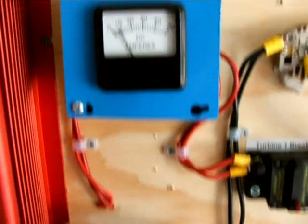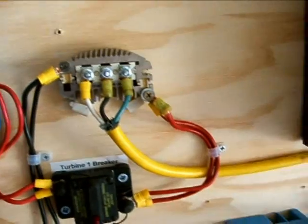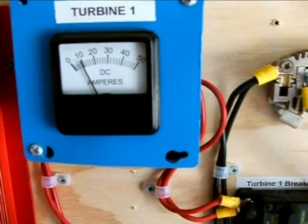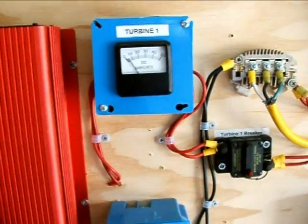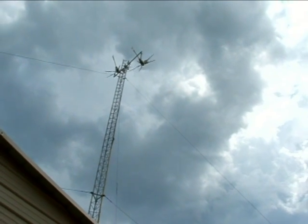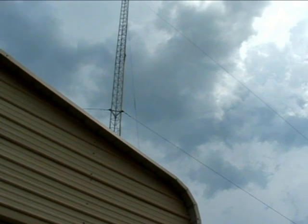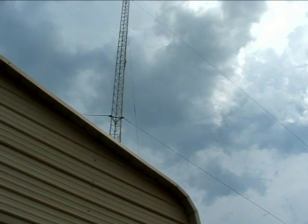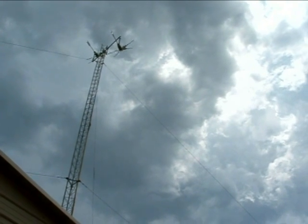You can see it's hitting about eight amps or so — about eight amps here. Very light winds, not a whole lot going on there. So right now it's 10 amps on one, so you have a total of about 16 to 20 amps between the two, on and off. That's 20 amps into probably a good 13 volts — right now it's over 14 because I can hear the dump load working, which means it's over 14.2 volts. So 20 amps into 14.2 volts is around 280 watts that we're getting out of a very light wind. So they're actually working out pretty well. That's it, thanks for watching.